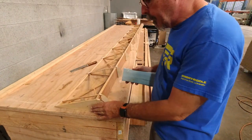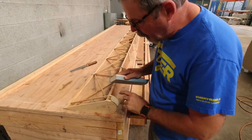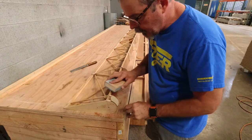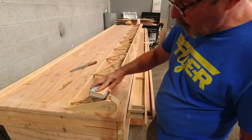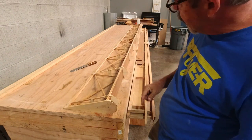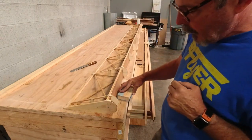All right, so now I'm just gonna take some sandpaper and work where I've cut these into the wood here. And since I have a little laser burn on these, I can make sure that I'm not sanding any of this away until I want to actually clean that up. So I'm just gonna go down each one of these and get it rounded into this member right here, the RS4, I believe, because when the plywood comes over, it actually gets stapled to this RS4. So I'll just make sure all these are smoothly faired into that on both sides. And then, yeah, that'll be great.